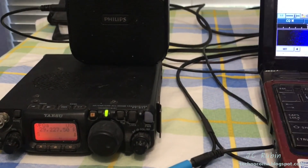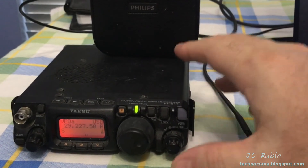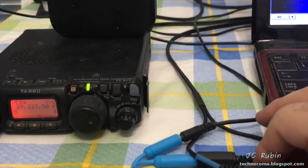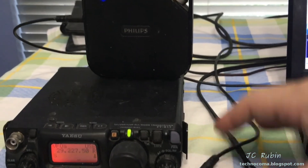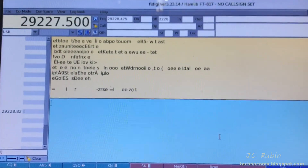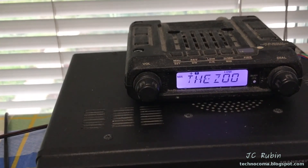That's all it takes to get the FT817 running on FL Digi. We spoke about setting up RigCat and the connections required through the serial to USB connector, the sound card related information, these cables, the Y cable for external monitoring, and the simple speaker — going through the configurations within FL Digi and some permissions within Linux. It's really that easy. This is KJ4TLB with a shout out to the 147.120 in Longwood. Thanks for watching.